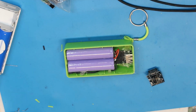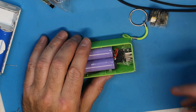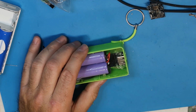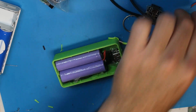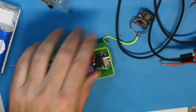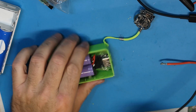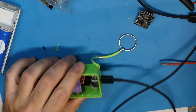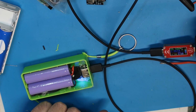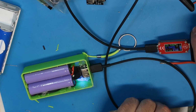Okay, so the first board unfortunately had an issue. I don't know, I will check it later, but anyway, the second one that I put in looks okay. So again, let's check 2 things. A lot of mess. The charging current. Yeah, so I'm connecting and it should be 2 amp. So it is okay, it is charging.